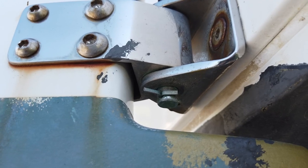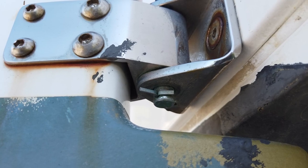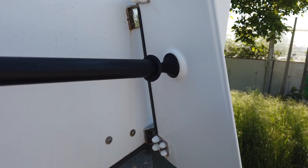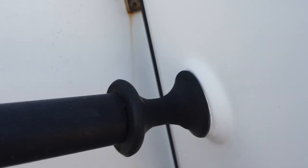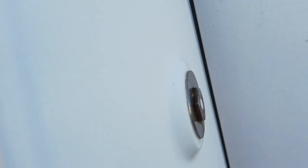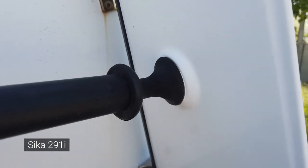Double-check the split pins of the rudder axis — they should be folded back properly. This one is definitely not. Next are the rubber connectors of the rudder system. Because they don't flex much, they will last for at least five seasons or more, but still check them for wear and tear and replace if needed. To replace them you will need to open the screw on the other side of the rudder blade and properly reseal them back using Sikaflex 291. The piece you are looking for is a universal power joint from Nautix, commonly used on surfboards.